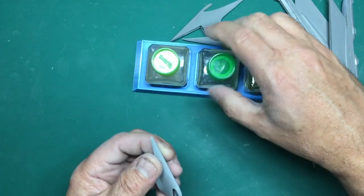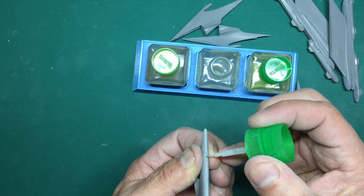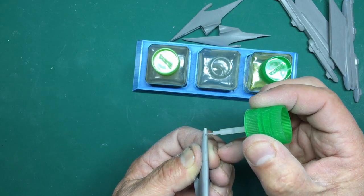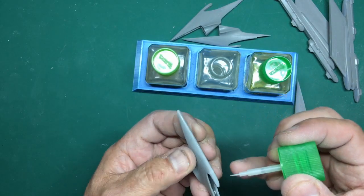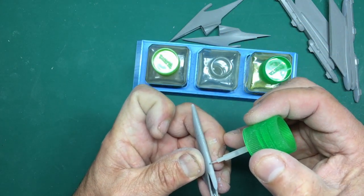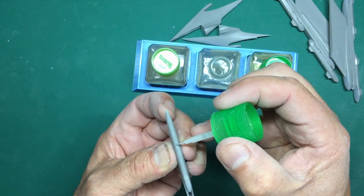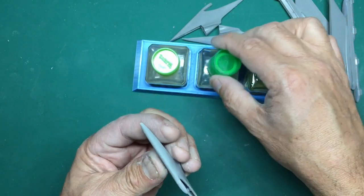And this is one of the issues with the extra thin being such a small brush. You can't get a lot of glue in there. And you can see that as soon as I put that in there, it capillaries down the joint. And now we're going all the way up. Look, see, all the way up here. We've got a white line appearing. And you can see the glue capillarying into that joint. So there we go. And now you can see it's completely split open.